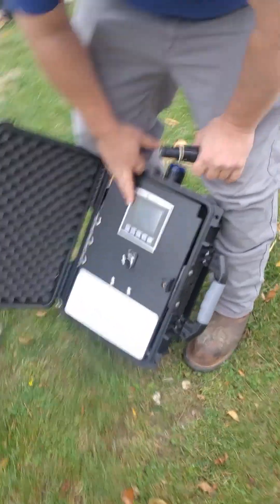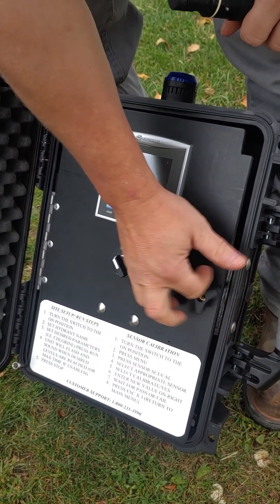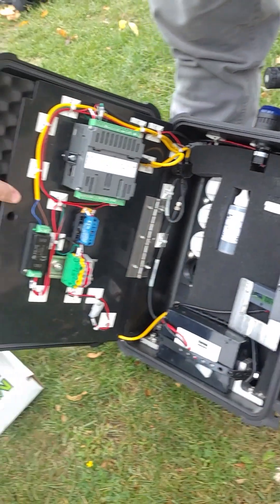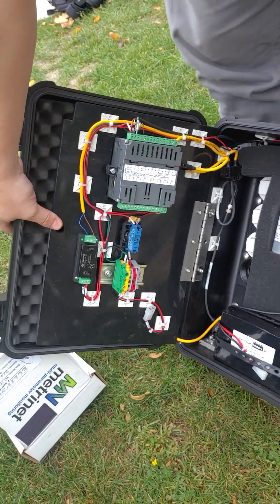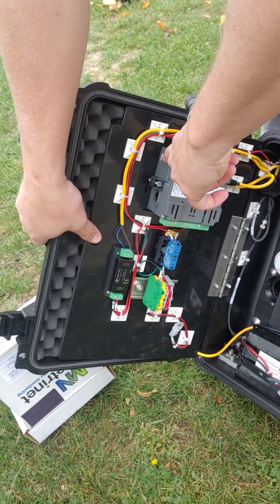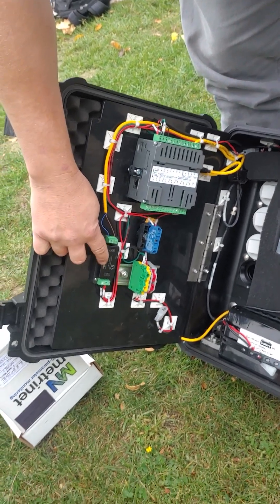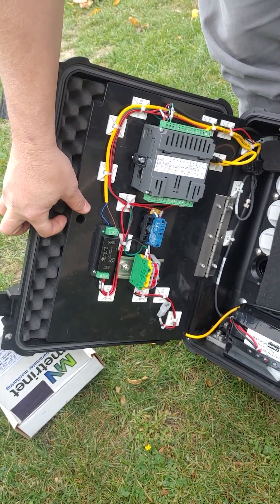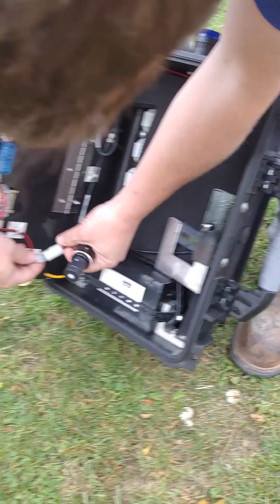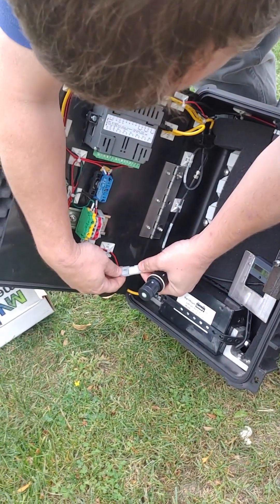Interface-wise, all you've got is your PLC. It comes with the steps on how to operate it right below. On the inside, the back of the PLC is where the SD card is stored — that's where it keeps the Excel files for all your flushing activities. This power supply just has to drop down the power a little bit for the sensor. And then you've got your battery — to charge the unit, you plug the battery into what looks like basically a computer charger.